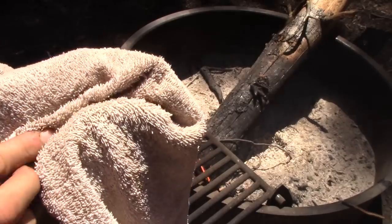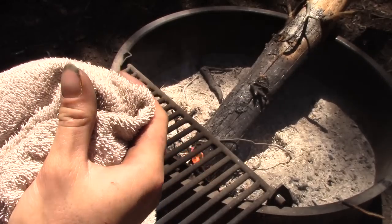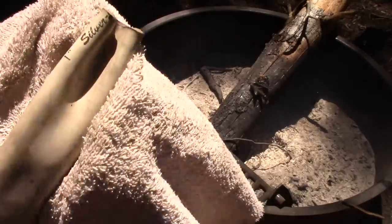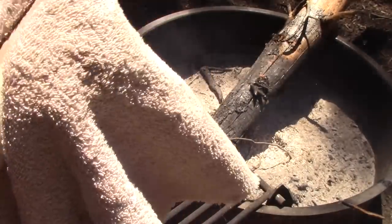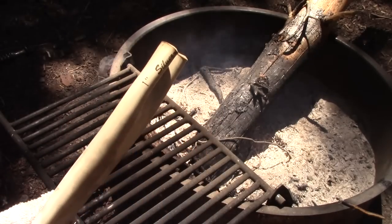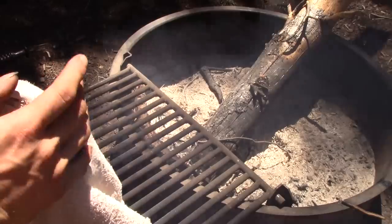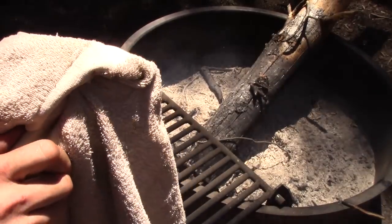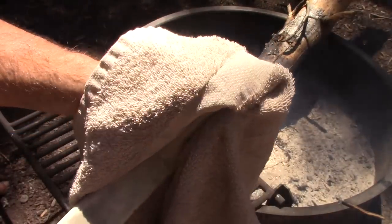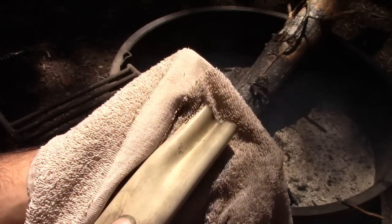So now I've been able to pull the crease longer and fold over more of the tip. So it's about where I want it. So in the next heat, it's going to be pressing this to its final thickness and starting to bend in a reflex here at the tip. So now I'm pressing it and pulling it forward. So this is a reflex, which means it faces away from the archer. This portion here is the part that faces the archer.